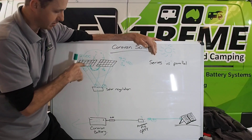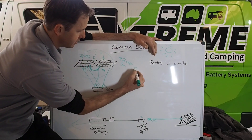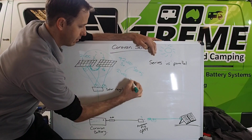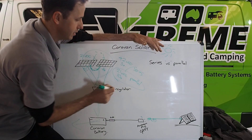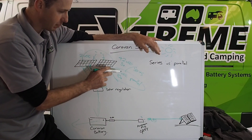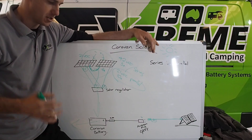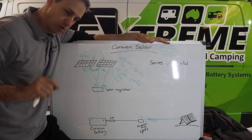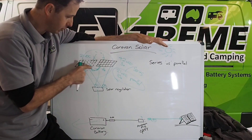As the amperage rises, you have to compensate with a thicker gauge cable. That's where the problem lies when you have too many in parallel — the amperage keeps doubling up. It gets to a point where the gauge of the cable would have to be monster-thick just to transfer the energy from the roof to the charge controller. The good thing about parallel is that if you shade one panel, it will not affect the other one — the other will still keep pumping out power. Blocking diodes inside stop feedback, so you're fine.